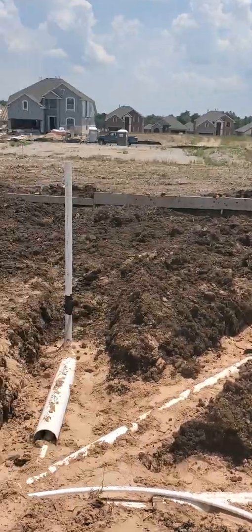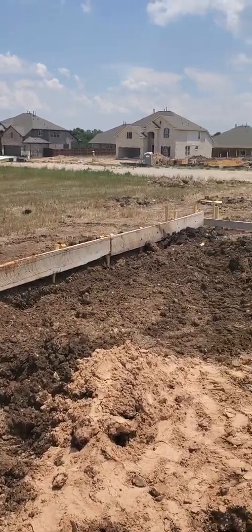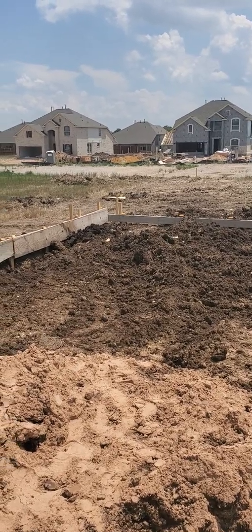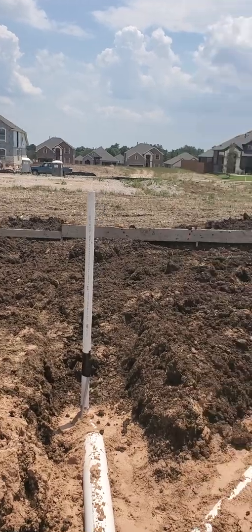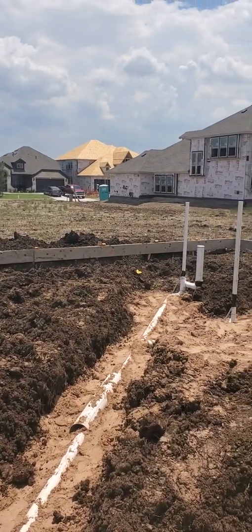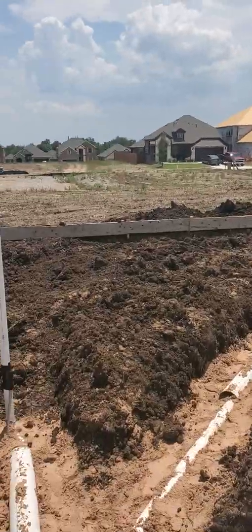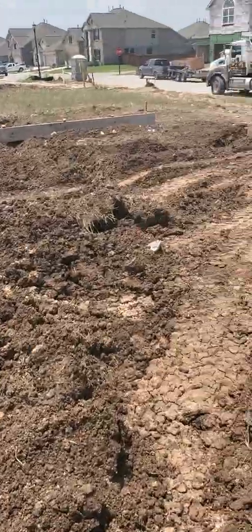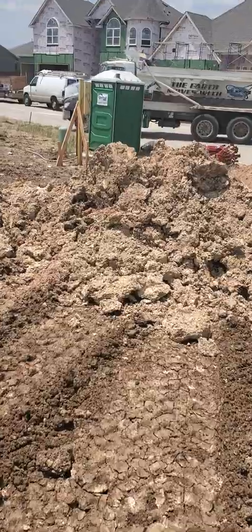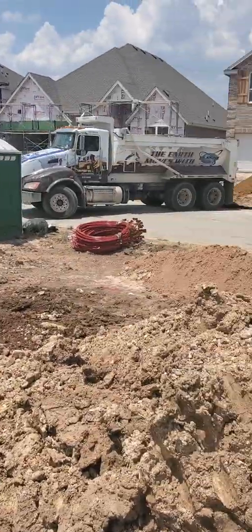I'm old school. The last house we built, I built with my son for him and his wife. We put 18-inch to two-foot footings, a foot and a half to two feet deep, and below that we put piers going 16 feet deep, then used rebar and steel. Not many people do that anymore — everybody uses post-tension now, which I don't care much for personally. But it is designed by an engineer. This is what post-tension cable looks like.